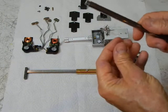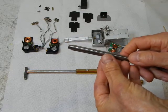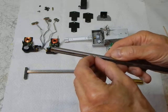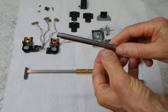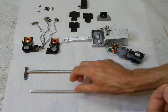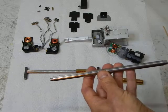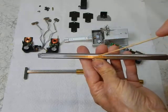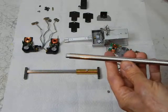The next thing I want to show you is the function of this. Sony does not give this bearing a name or even a part number, but it rides right in this channel — this groove in this arm shaft. As the arm goes left and right in and out, it rides in this channel. Its function is to produce a mechanical limit for the arm pitching, locating it properly so that the Biotracer electronics have a reference point to work against. These arm shafts come from the factory with a little bit of ripple on the upper and lower face of this channel.